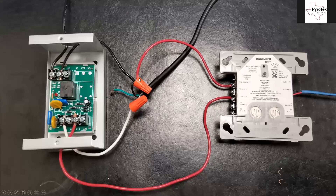This other side — this red wire comes over and hits our common two on our addressable relay. Then it hits the normally open two on the addressable relay to come over here. That way the MR-101 stays in its normal state most of the time. Then whenever we activate this relay, it turns on the MR-101, switching that contact.